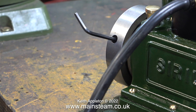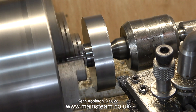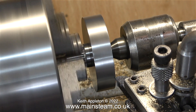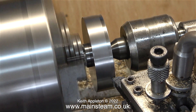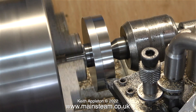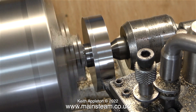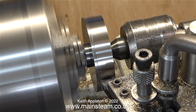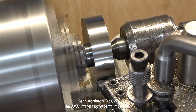The next thing to look at is the flywheel. It's not running concentrically on the crankshaft, and the crankshaft is not bent. Whoever built this engine drilled down through the grub screw holes and into the crankshaft to locate the grub screws — this is never a good idea in my opinion. As the fitting that's bolted to the front of the flywheel runs perfectly concentric, I put that in the chuck and used a live centre in the hole at the other side of the flywheel to keep everything solid and rigid. Then at a medium speed, I carefully turned down the outer diameter and as you can see I'm getting quite a good finish straight from the lathe tool. When machining cast iron in the home workshop, it's not a good idea to run it too fast.